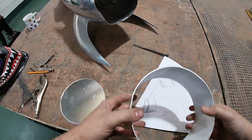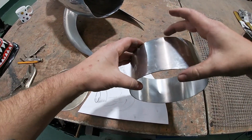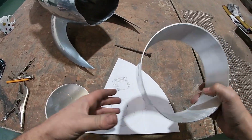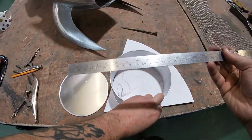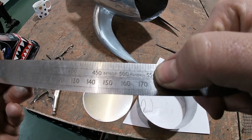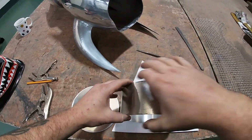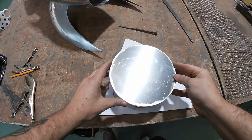So what I've decided to do is I've made up these bits. This is basically just the 80mm strip. Actually, we've got a clever little doohickey here. I'll show you this clever little thing here. Because I know the diameter was 176, if you can see there, that is the circumference. I have no idea where it's from, it's my dad's. That's how we come up with the length that will fit perfectly to our back circle.